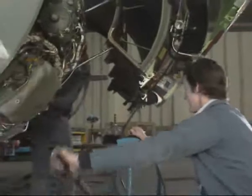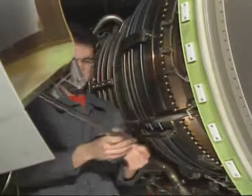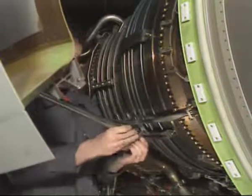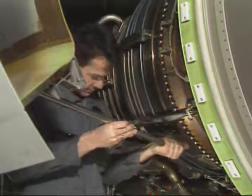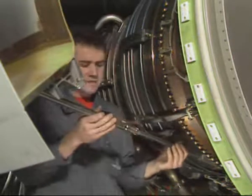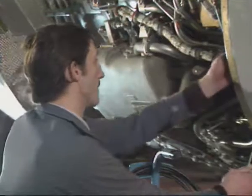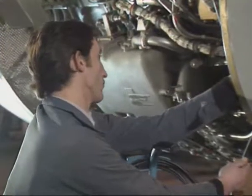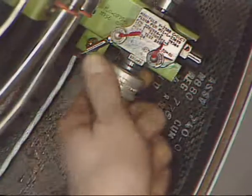When the door is opened, unstow the hold-open rods from their storage brackets and attach them on their supports on the engine core. Unload the hand pump until the rods hold the weight of that half. Disconnect the hand pump manifold and put the cap on the quick disconnect.